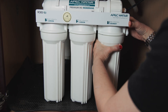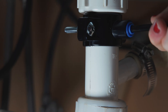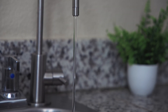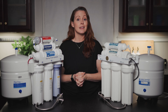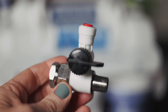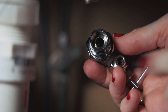How about usability? Both systems are easy to install and very similar in setup — you drop in three pre-filters, connect a feedwater adapter to the cold water line under your sink, install the drain saddle, mount the faucet on your countertop (which might require drilling a hole), prepare the storage tank, hook up all the tubing, and turn on the water supply. For priming, the iSpring has you let the faucet run for about 30 minutes, then fill and drain one full tank. With the APEC, you can skip that first step and just fill and drain the tank once before use. We did run into a couple of small issues: with the iSpring, one filter leaked at first due to an oversized O-ring, but that was easy to fix using a backup from the box. The feedwater valve on the iSpring also felt a bit flimsy. On the flip side, the APEC's feed valve leaked too, apparently due to a missing gasket, and we couldn't fix it — so overall build quality between the two ended up about the same.